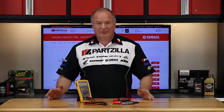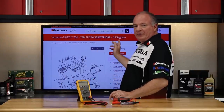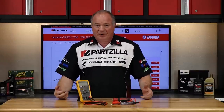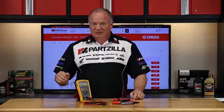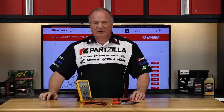Welcome to the tool bench. Now typically I can tell you exactly what tools you're going to need to do a project. Well, we're in a little bit of uncharted territory here, so let's just start with the basics — get a Phillips, a test light, and a good volt ohm meter. What is more important is to look at our exploded diagrams. That's going to show you where each different electrical piece is located on the machine. I really don't know what parts to tell you yet, but at the end of the video, whatever we choose will be in the description at the bottom of the page. So once you've got your tools and your diagrams, we can go over there and try to pick this apart.